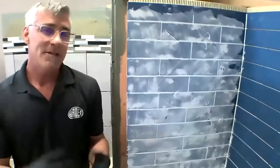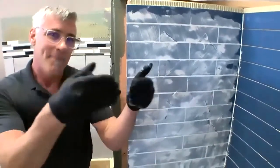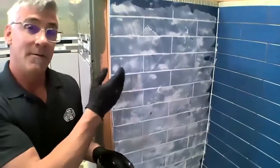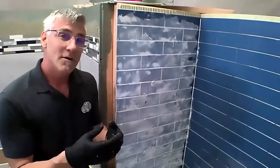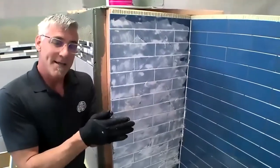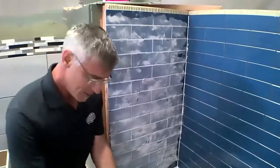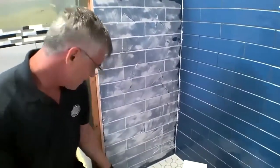Also, in submerged glass tile installations or even steam rooms, because what happens is moisture can get back behind the tile if it's a glass tile and discolor that mortar. But if you have an epoxy adhesive, which is our ARDEX WA, and I would recommend using the Brilliant White in that application, that will never discolor, and also glass tile can be very difficult to bond to because it's impervious, right? So in a submerged application, you're going to get a good bond and you won't get any discoloring of the mortar or adhesive as it begins to get wet behind the tile. It's a great question. Do you have any other questions coming through? No, sir. All right.